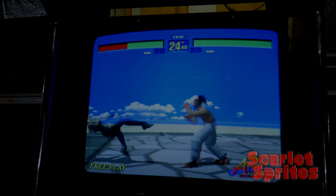Let's go ahead and check out the picture up front. Well, the picture is gorgeous — I don't think I could have expected it to turn out this good. The colors, everything is vibrant and bright. I did do a little bit of an adjustment on this; the picture was scrolling a little bit but that wasn't anything with the board work — that's just the chassis having to be connected to my tube and configured a little bit. You can see underneath here we've got the red, green, and blue bias settings which will increase or decrease those respective colors in the picture. Got a brightness switch and then the horizontal and vertical adjustments as well — just a little bit of a pain to take off the front to adjust, but it should be a one-time thing.